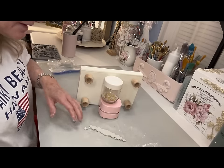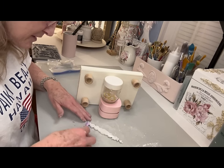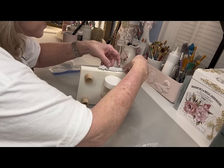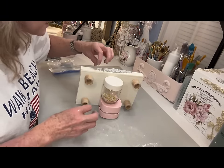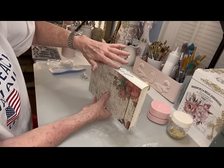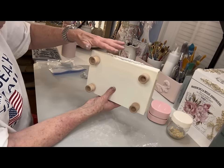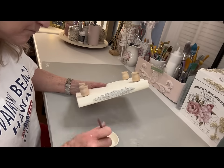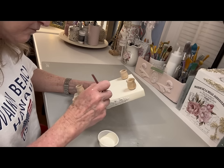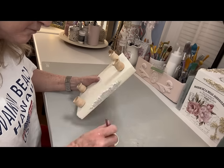I don't want it to move at all, so I stack everything on both sides of that little book so it's not going to wiggle around and accidentally fall when I'm putting this particular mold on. Once again I use the Titebond Thick and Quick. Once I get it all set on, I let it set up for just a little bit, and then I go back and paint it with Rust-Oleum Chiffon Cream. When you first put it on, it's just good practice to dab at the edges a little bit. You don't have to wait until that particular mold is completely dry to paint it — going ahead and painting helps reduce cracking.